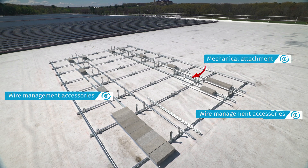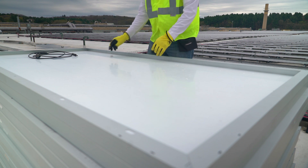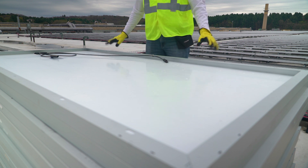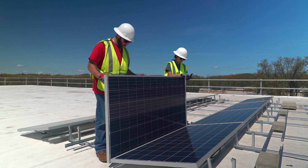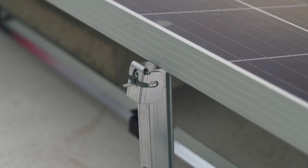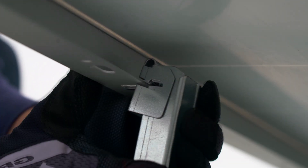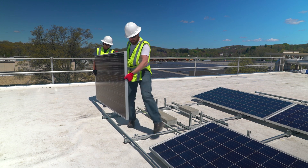Other accessories for wire management can also be installed at this time. Step 5: Install modules. No tools are required for this process. Before attaching modules, it's recommended that you prep module leads. Place the module on the cam seat. Place the cam claw over the module flange and apply a small amount of force to make sure it's properly seated. Rotate the module downward, resting the module frame on top of the tilt arm. Lift the module slightly, then push the tilt arm forward so the module frame rests on the lock claw tongue. Pull the tilt arm toward you until the lock claw is fully engaged onto the module frame flange. Install remaining modules similarly.